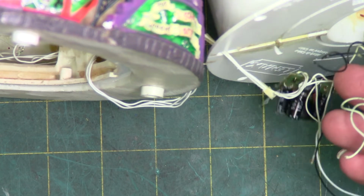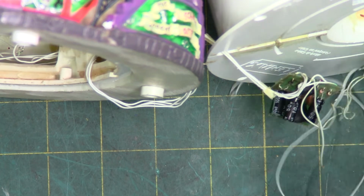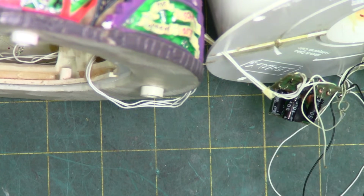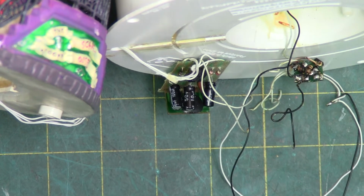Alright, over here on this little bitty circuit board, you have, I told you, the resistor, a transistor, and then 2 diodes. And there's actually 2 resistors, one on the top, one on the bottom, sorry. Both resistors are 150 ohms each, and they're actually parallel to each other on the same circuit, which brings it down to 75 ohms of resistance on this little circuit board right here. Because when you take 2 resistors and parallel them, it cuts the resistance in half.